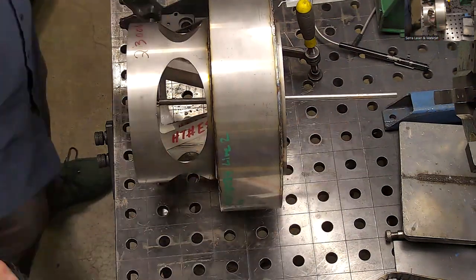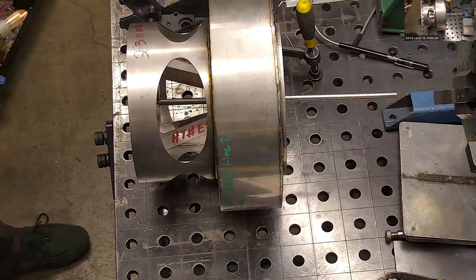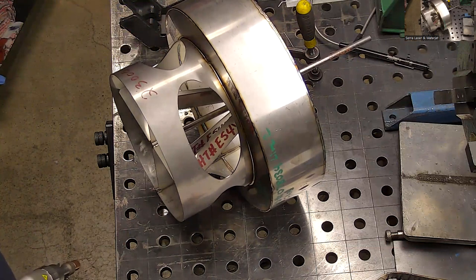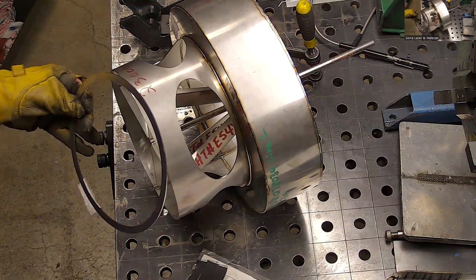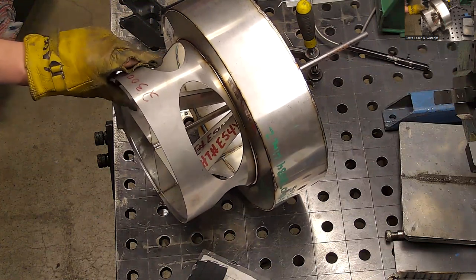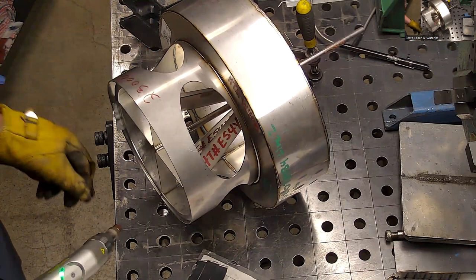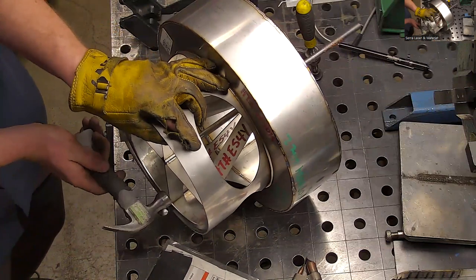Got it. Okay. Just eyeball it a quarter inch, and then you have to weld it up. Usually that bottom plate will be in the way of you welding it, though. Yeah, that's true. Oh, the ring? You can't weld the ring afterwards? I usually weld the ring first. Well, you could weld the ring afterwards if you set it in the right spot. If you don't set it square, that bar is not centered, then you get the wobble. You may try to weld it with the ring there, just for reference. Yeah, well, it shouldn't matter.